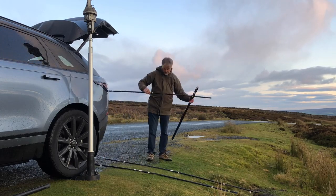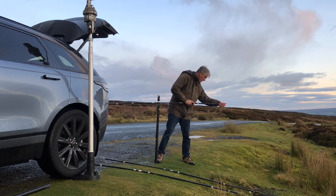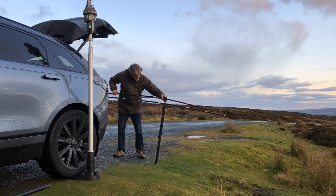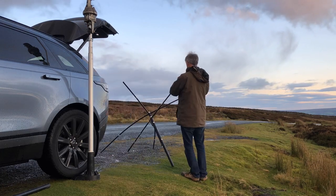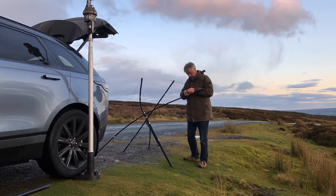This is my Mini Horse antenna for 6 metres. It's a simple design — I'll put a link above to the build and you can follow that. You can make it for different frequencies. If you're thinking of building something like a Moxon, why not go for three elements and get that extra gain? Very cheap to build and very easy to put together.